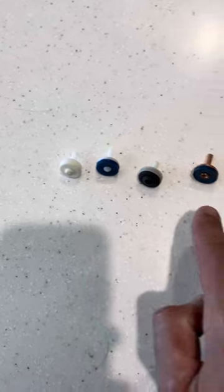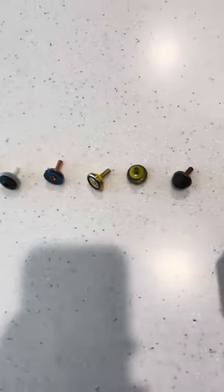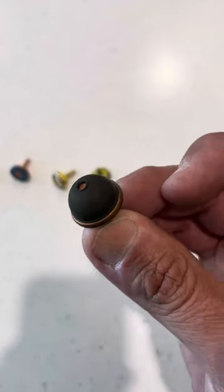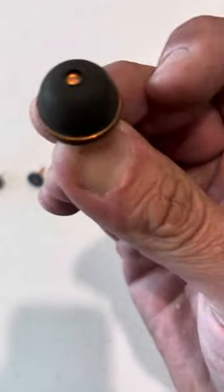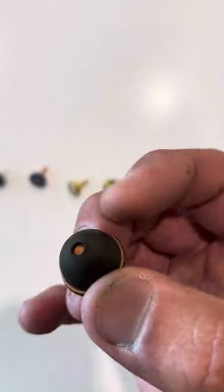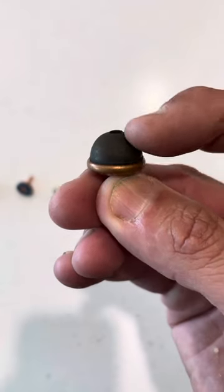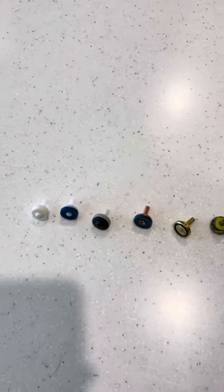So if we're not getting the perfect seat, you probably want to be looking at these first four that I've mentioned. If you're looking at a seat which is really far gone and you're looking for a short-term solution, then the dome washer is where you want to go. Also, if you're looking for an easy-to-turn-off solution for someone with arthritis, the elderly, or children, then the dome washer is not a bad option either — but be careful of over-tightening and the lifespan will be shorter.